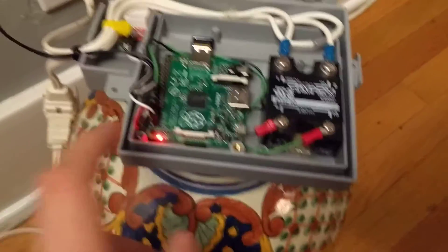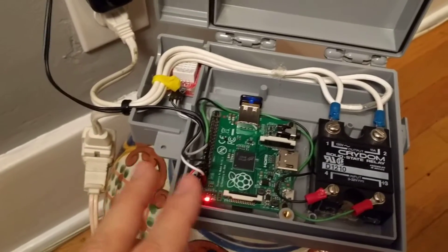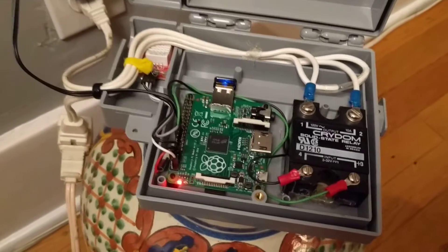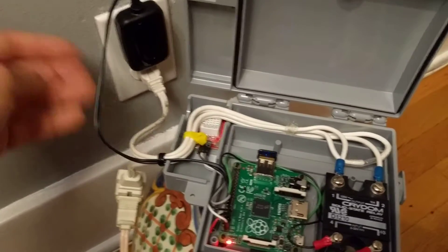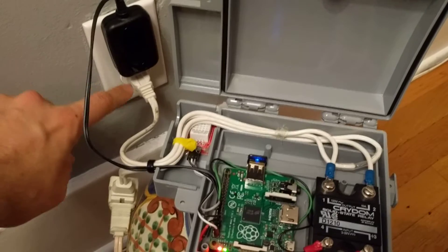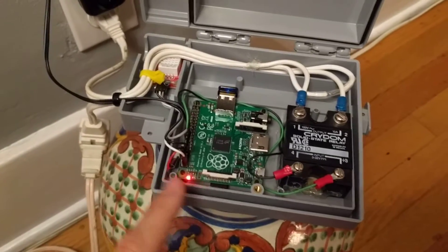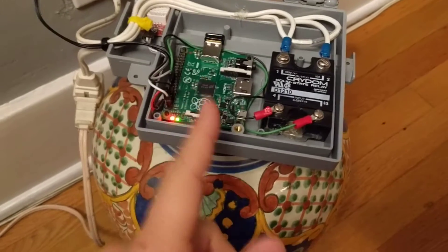And GPIO here. I also installed a temperature humidity sensor. I had it lying around and I figured I'm going to be sticking this outside on my front porch — it'll be covered so it won't get rained on. The connections are short because I already have the power and the Christmas light connections all in one spot. So I'm going to power up the Raspberry Pi with this, plug this in for the solid state relay, and the Christmas lights will plug into this one. I'll use cron jobs and whatnot to control the lights, or I can do it from my phone — it's Wi-Fi.